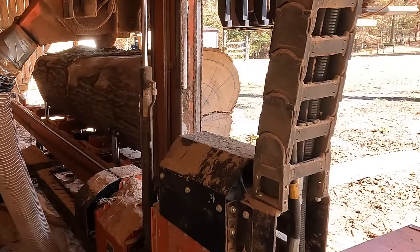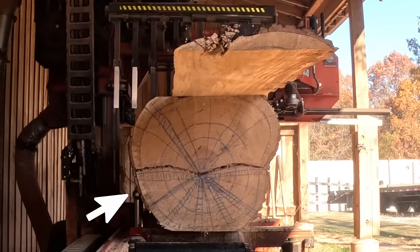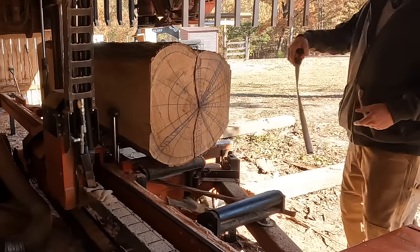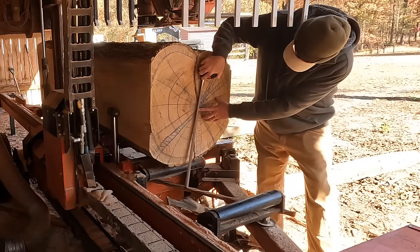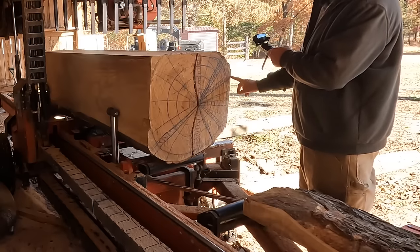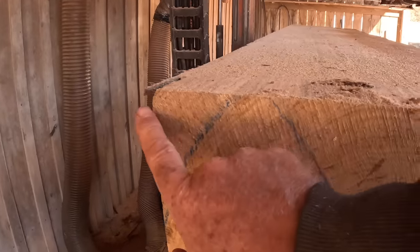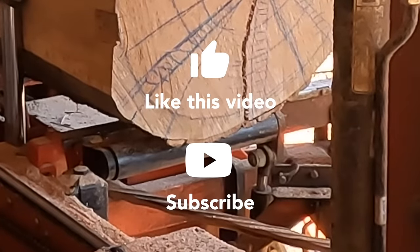This is one of the reasons you like to have a wide head sawmill. This is a big wide log — I'm going to try not to waste too much of it. That one is right at 19 and a half. You want to leave enough meat here so you can cut this facet. This log is so messed up on this side it does turn out I've squared this corner off — normally you try to avoid that but I had to do it. Always drop your toe boards before you make a cut and forget they're up.